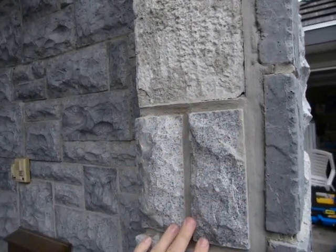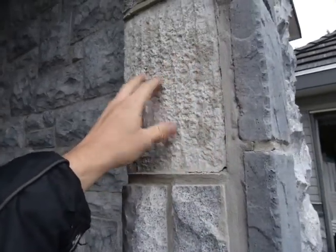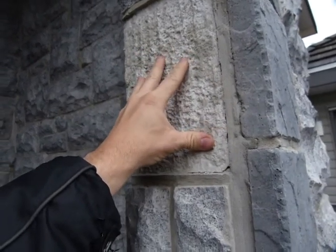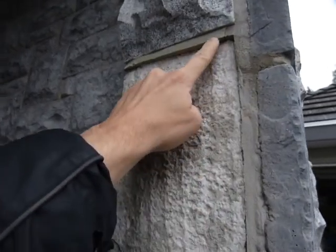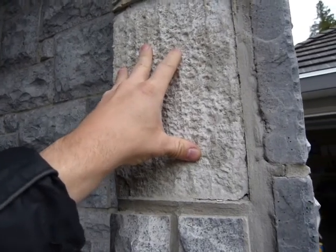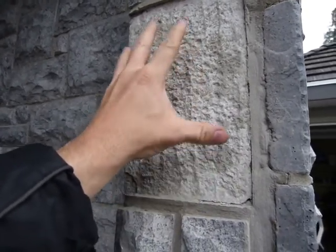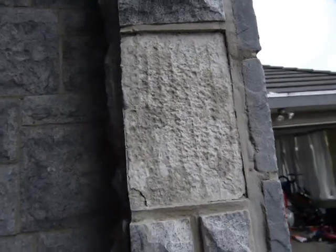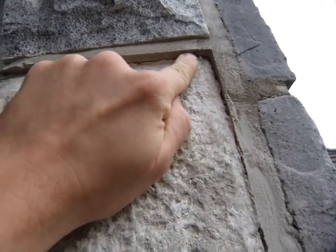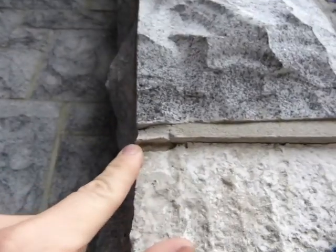You can see that this brick has a raised textured finish, and on the back side there are some small ridges. What I can see is that on the back side of the brick there is no mortar. Here is mortar along the edges but I don't see anything on the back side of the brick — that's not normal. The back side should have what's called back buttering; there should be enough mortar there holding the brick in place. What I'm also seeing is that the mortar joint is extremely uneven — there is something in the corner and it's tapering off to barely nothing in the other corner.